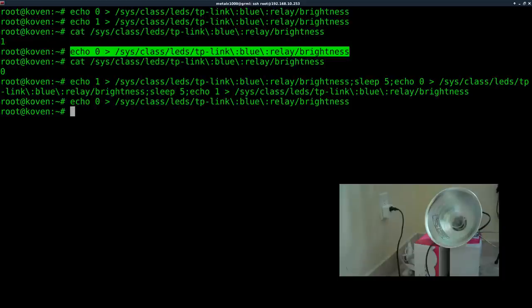And also, again, I'm going to try to make a web interface so I can access this with my phone or tablet. And also at this point, right now I'm connected from my desktop directly to the device through Wi-Fi. I want to get it on my network if possible. Of course, that's what it's designed to do, but I need to figure out how to do it without their proprietary application. Worst case scenario, if I can't figure it out, although I should be able to, I have a root shell here, I just need to look at what tools they have for networking. Obviously it has the capability of doing it, but let's say I couldn't figure it out. I could always install the device or the app on a virtual machine and then get set up and then remove that virtual machine.